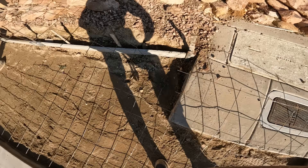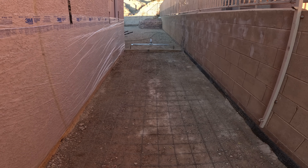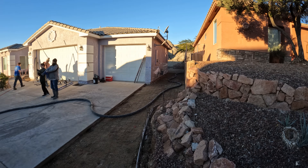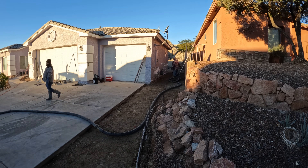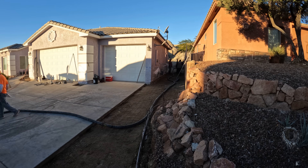We're going to be putting some wire mesh in here. This is 10 gauge, six inch by six inch squares. And it doesn't really prevent cracking — all it really does is prevent the cracks from moving, so you're not going to get lifting, heaving, or separating. That's all the wire really does. It just keeps the cracks to a minimum, but it will still crack.